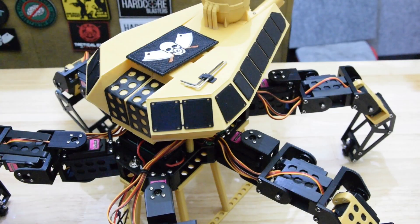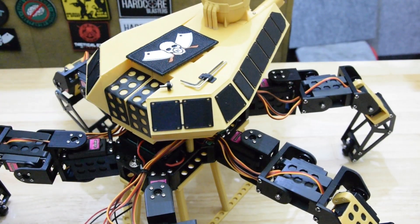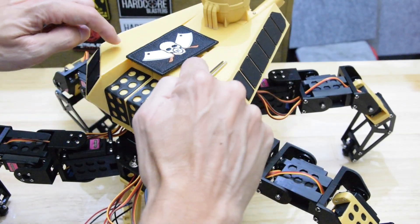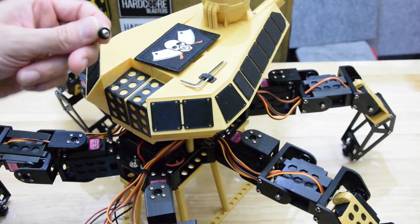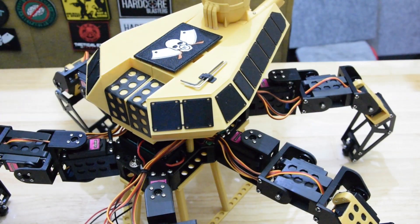What I'm going to do now is wire up this relay so it'll operate the gun when I pull the trigger on my PS2 controller. There's some other things I've done while you were away — I've printed off some little cap head things for screws. Basically, this guy is going to screw from the bottom onto the posts that this turret mounts on. These are mounted in an 8mm hole, and this is a 9mm thing, so I'll be able to screw it through the bottom and that'll just stop it from falling off — give it some attachment point that's not undoable. I can remove it for maintenance.